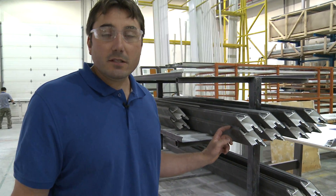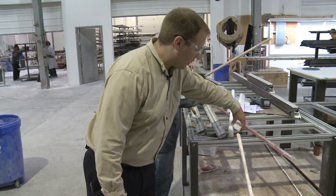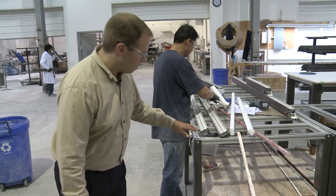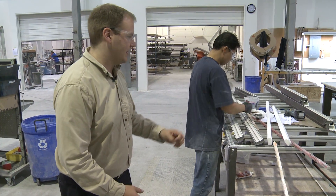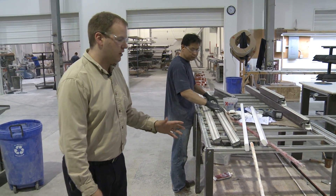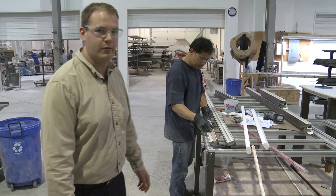After the milling and drilling process is complete, the lineals are rolled out on dollies ready for frame preparation. One of the technical aspects of the windows is the fiberglass frame's ability to accept styrofoam insulation. We use EPS foam insulation in all the primary cavities of the frames. The frames, being made of fiberglass, are stronger than vinyl so they don't need any webbing or intermittent frame components — this larger, more open frame cavity allows for full insulation fill all the way down the frame. The thermal improvement gained by filling this hollow with foam is around 25% better than if there was no foam in the same frame cavity. It's not the end-all be-all in terms of performance, but it is significant and as a low-cost improvement, it's an excellent addition to the window from a technical perspective.